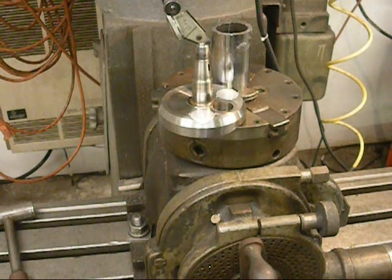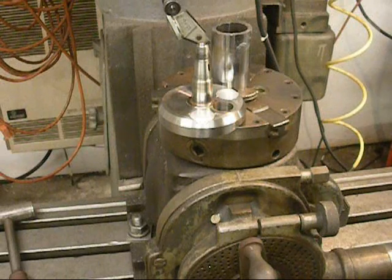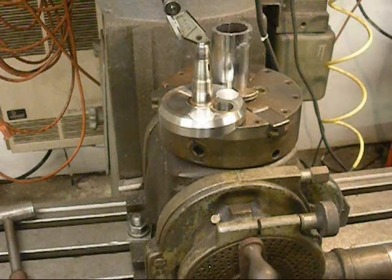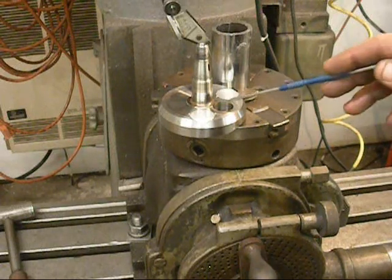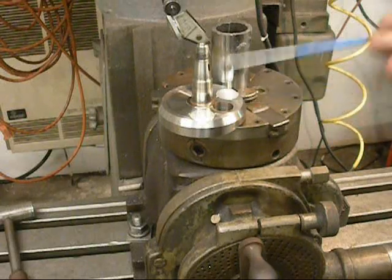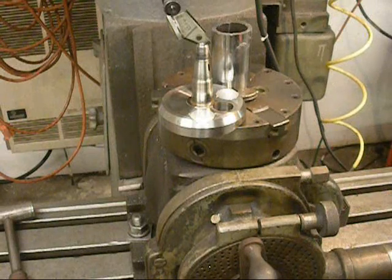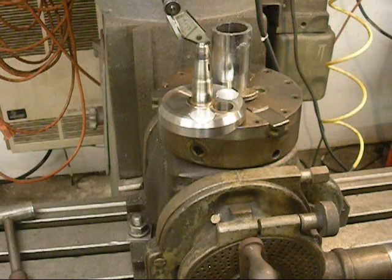Hello, welcome back to Ken O'Connor Racing. This is a crank web off of a KT100 - a Yamaha crankshaft. They use these in karting. We can definitely stroke this crankshaft, and that's what my customer wants. He said five to seven millimeters of stroke. I'm going to run with five, which will square this engine off nicely as far as bore-to-stroke ratio. Right now the stroke is shorter than the bore, and this will get it within a millimeter.